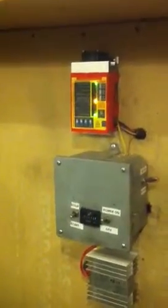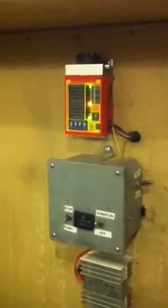I've also taken the bridge rectifier out of the alternator to get some heat out. I found we were about twice as efficient with an external rectifier than with the internal one. Plus, we get some of the heat out of the compartment in here, which is a good thing because it puts that heat into this room.